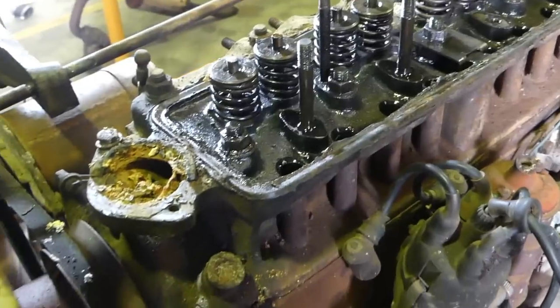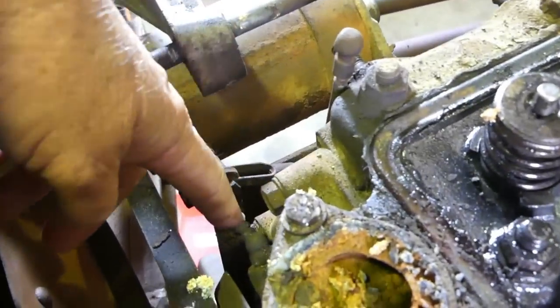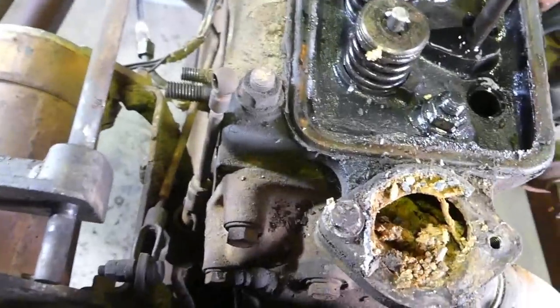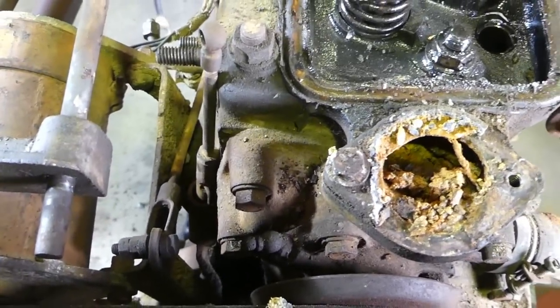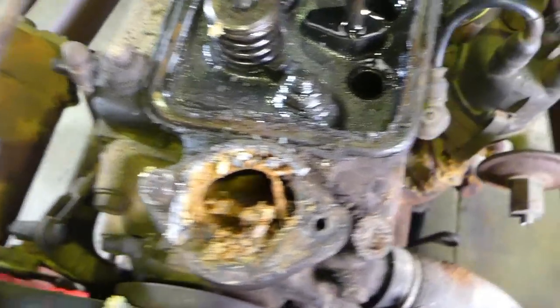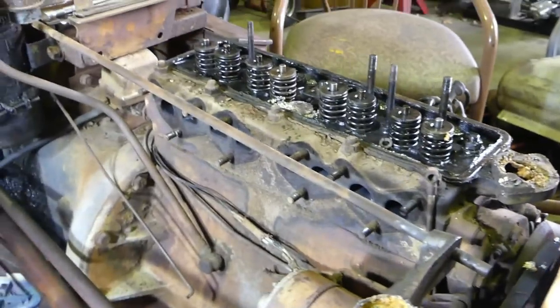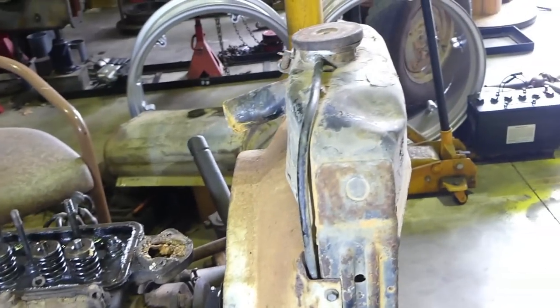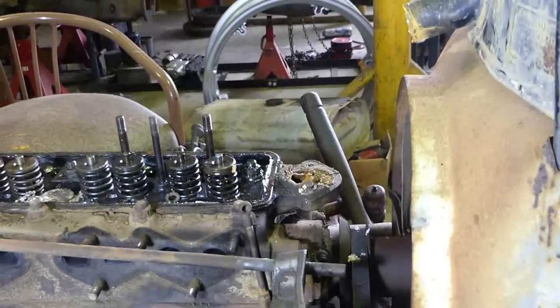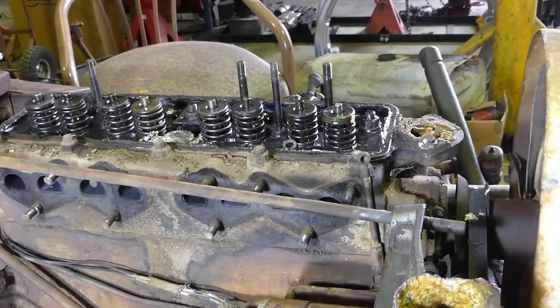So this is certainly going to take some tidying up. Because the water pump is bolted on, we have a couple of bolts here — one, two, three, four. We could loosen it off the front and slide it forward, but since we're doing the full engine rebuild, I've loosened off the bottom radiator bolts. For ease of filming and getting organized, I'm going to take the radiator off.